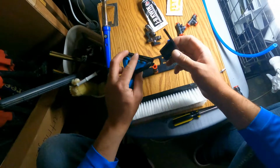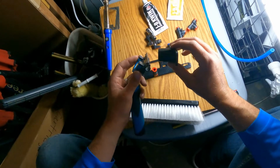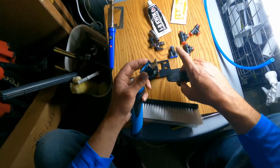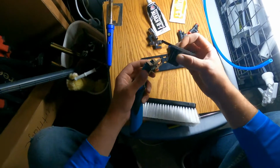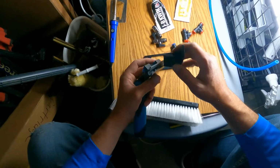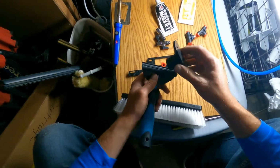I'm going to be molding and shaping this piece to get it to the right angle, and I'll use my other one, because that was one thing I had to adjust a couple of times. Make sure before you put the JB Weld on at the very end that your angle is right. Use it for a day or so, because the plastic will hold pretty well, but you want the JB Weld over the top to give it a really good bond. So I recommend you plastic weld this, figure out the angle, and just keep heating it up.